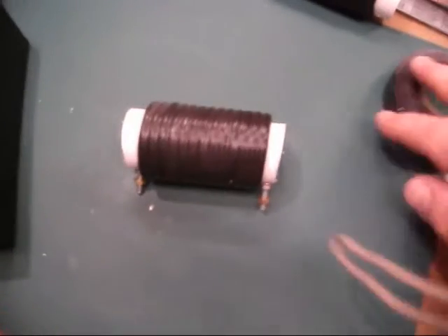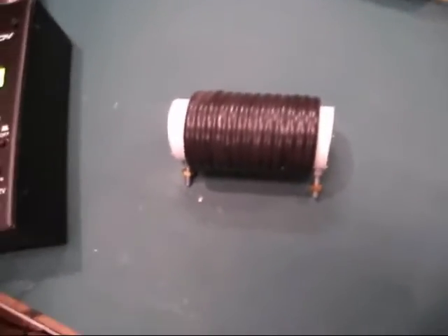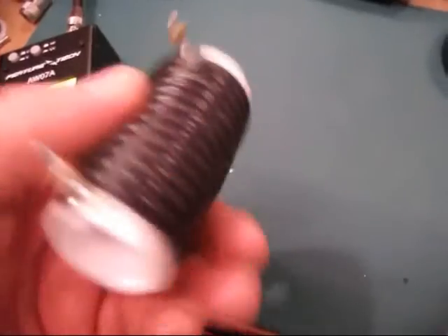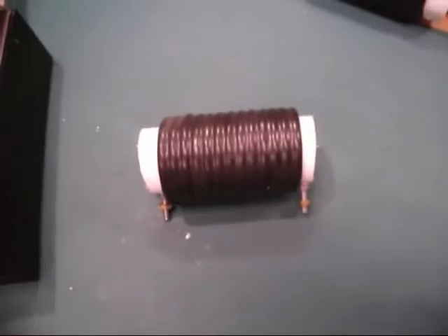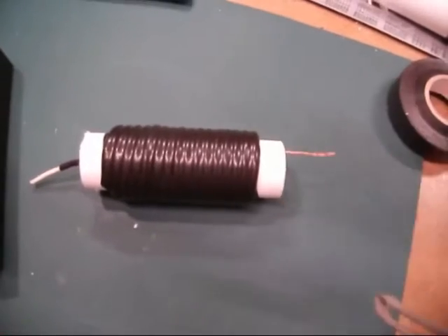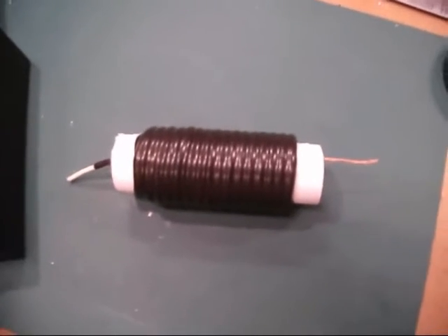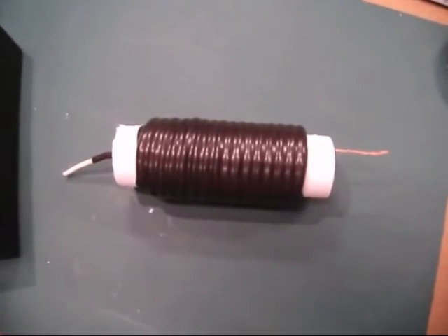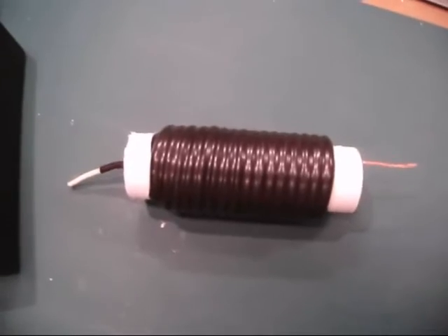So I went away and built one. This was Mark 1. The problem was the article describes a 40mm diameter waste pipe, but I only had 32mm diameter pipe. I built it thinking it wouldn't make much difference — how wrong I was. So I did some searching on the internet and found that if you're using 32mm pipe, making the coax length 180cm will give you a resonant trap for 40m.